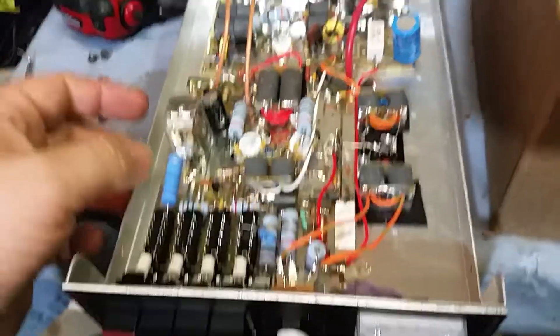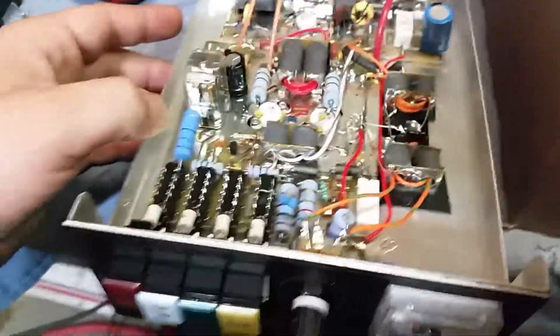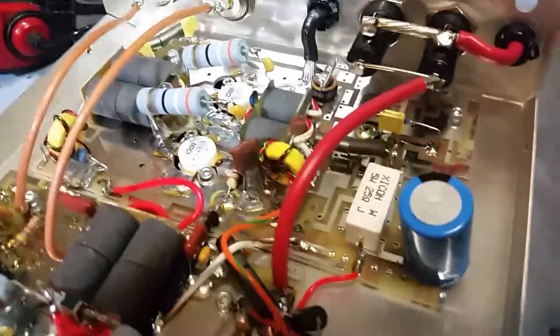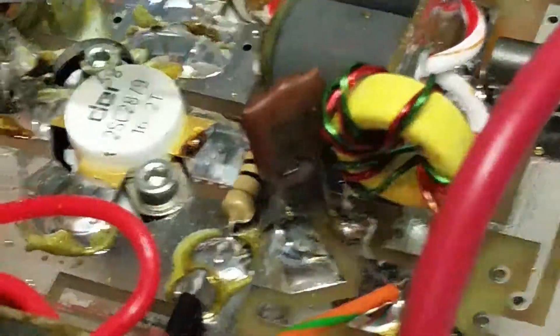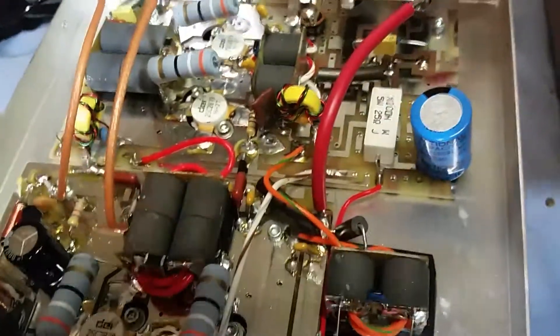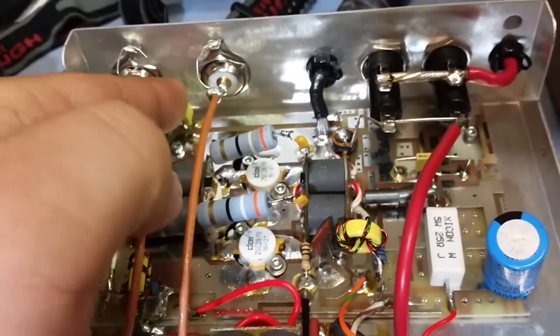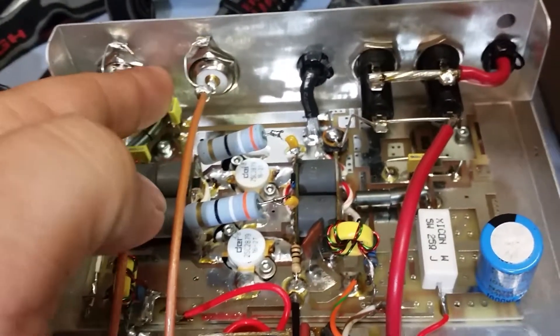Some models don't actually need them, but I'll check it out and see. Here is the second one. You can tell this is the DEI model. This capacitor right here is a 220 pF cap because of the input tune. The input impedance of DEIs are a little different than Toshibas, and they normally do tune down a little lower. You can see Texas Star is going back to the box-style filter caps — really whatever is cheaper, it works the same.